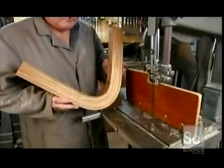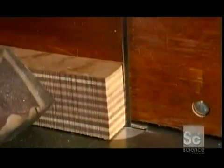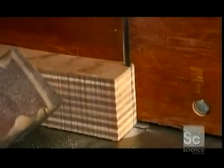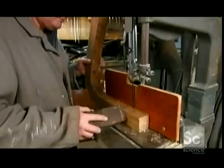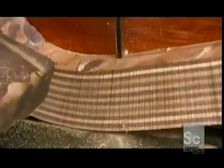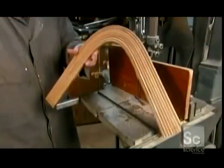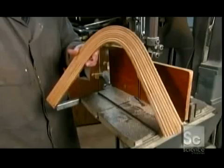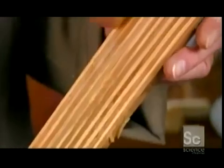The next day, the laminated piece of wood is removed. It's solid but far too chunky to take flight. A woodworker slices it into pieces 8 to 12 millimeters thick. One piece of laminated wood yields about 6 thinner pieces, each of which will become a boomerang in its own right. But it needs more form, and those rough edges have to go.